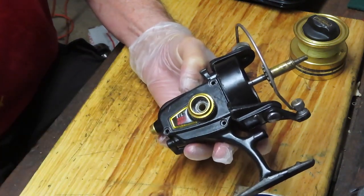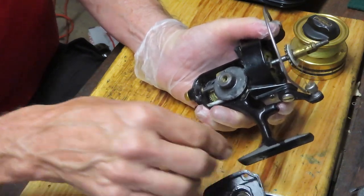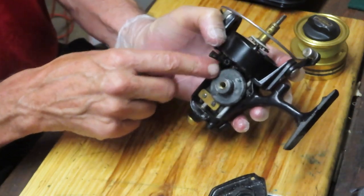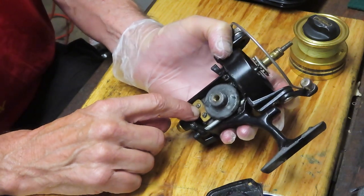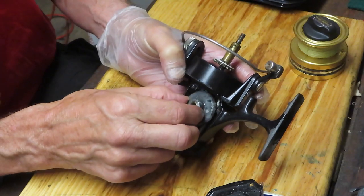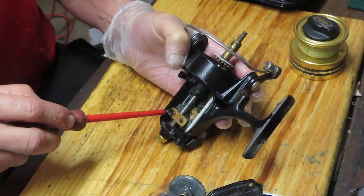To start, you remove the three side plate screws. As I remove the pieces and parts, I want to encourage everybody to subscribe to my channel and use that notification button so you can see all of the ones I'm posting. We have two screws holding a plate that locks the axle shaft against the crosswind block, and those screws have to be removed in order to remove the axle. If you try to pull the main gear out right now, it can come out, but to get to the pinion gear, you have to remove that axle shaft.